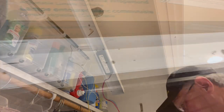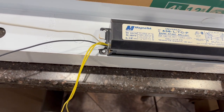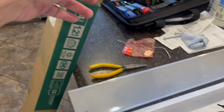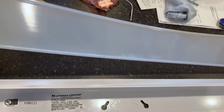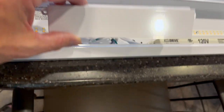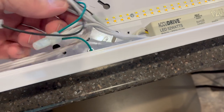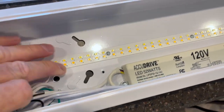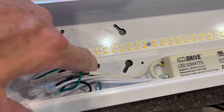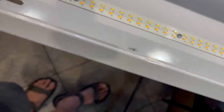One down, one to go — the old one is out. One note: be careful, this ballast has a little bit of weight to it, so when you're working above your head you definitely want to keep an eye out. All I've done so far is take everything out of the box. It's taped so it's easy to pull the cover off. There's a little cover here that covers the wires. I went ahead and removed that to expose: green for ground, black for hot, white for neutral. Right here is where I'll bring the house wires in. I also went ahead and popped out the little knockouts — this will be how I secure it.